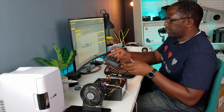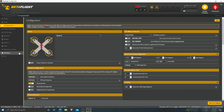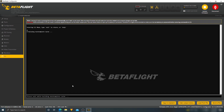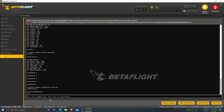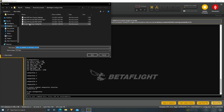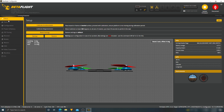I'm going to power my transmitter here. I can see my motor rotation — that's good to know when I put my props on; they are spinning inwards. Before I do any of that, I'm going to save the factory settings on this quad. I'll type DIFF ALL in the CLI, hit enter, and then save this to a file so that in case I screw anything up, I can return to factory settings. I'm going to name this 'Smart 35 Config File - Factory Config File 2' and save. It saved successfully.